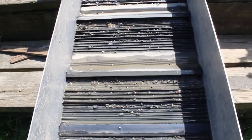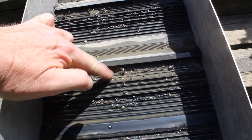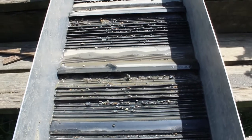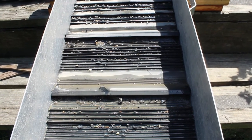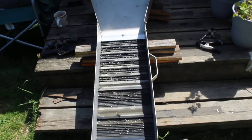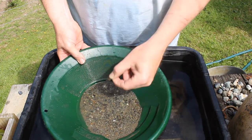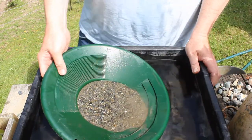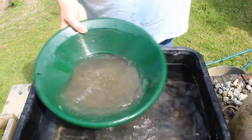Now the water's run out real good. You can see right in here all this stuff caught in there. That doesn't just fall in there — it actually gets sucked up in there because of the low pressure formed from the water flowing over it. Like I said, if the water's too deep it doesn't do a good job, and if it's too slow it doesn't do a good job either. I didn't know if I did a good job or not, but I didn't lose anything because I got it all in the tub. We'll pan this out and see how we did. I didn't get as much material as I thought I would, so I might have lost quite a bit. But I ran it really slow because if you go too fast you end up kicking the gold out before it gets a chance to settle.